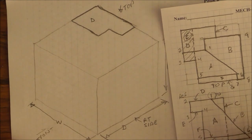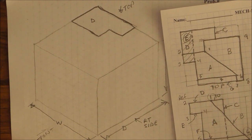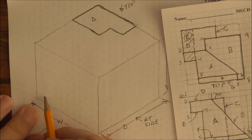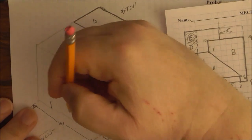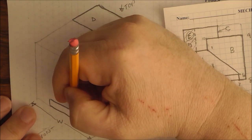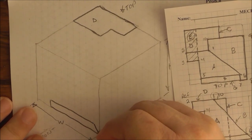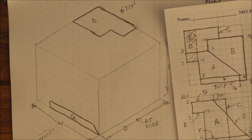The front of the box is plane G. Don't look at the front view — look at the right side view and you'll see this is the front of the object. Plane G is right here: it starts 2 units from the left, it is 1 unit high, and it looks like it's about 9 units long at the top and 10 at the bottom. That's G — that's all it touches on the front side of that packing box.